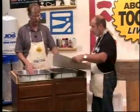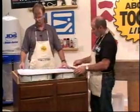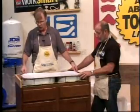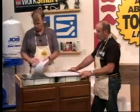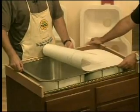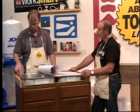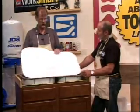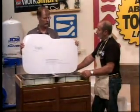That is correct. This would be a completely pre-finished cutout, obviously. And as you can see, this is designed to match a little bit greater than the curve of the rim, which is a typical design. So it leaves a little bit of stainless showing, and it gives you plenty of flange to still glue with. All good bowls will typically come with a manufacturer's template.